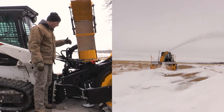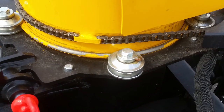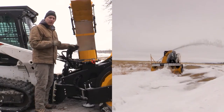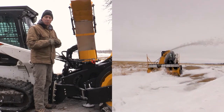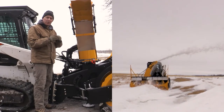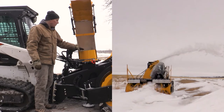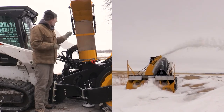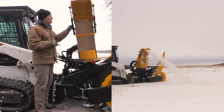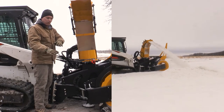The chute is a 14-inch diameter base chute using five rollers on this larger design. The roller design is very important and specific — we make it this way so that it does not freeze up as easily as a typical snowblower where you have plate-on-plate contact. Here we have a rolling surface on a rounded edge of the chute. It's a more expensive method but done specifically to prevent chute freeze-up. We're using twin cylinders on the chute deflector for an even load, and you can see the four-segmented deflector that gives a nice curve if you want to blow the snow down right next to you.